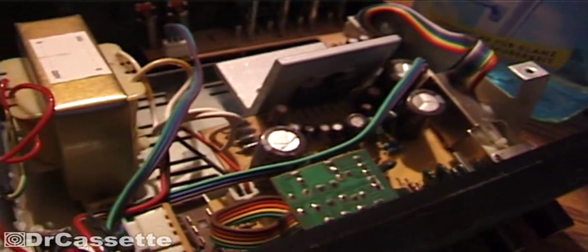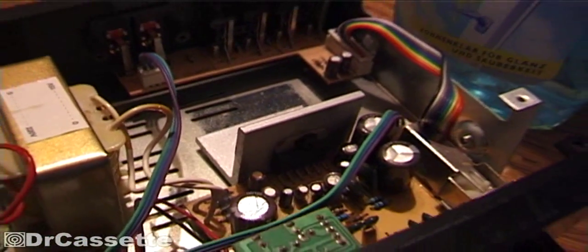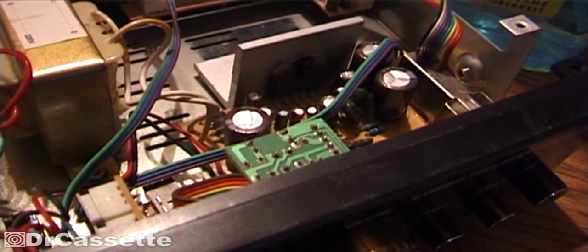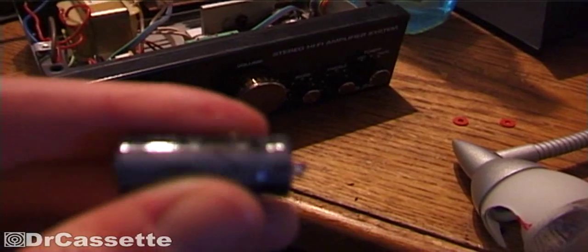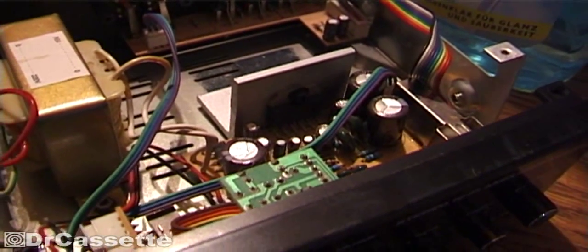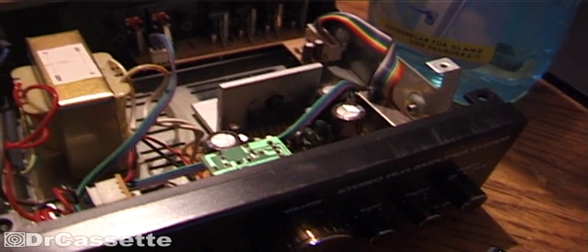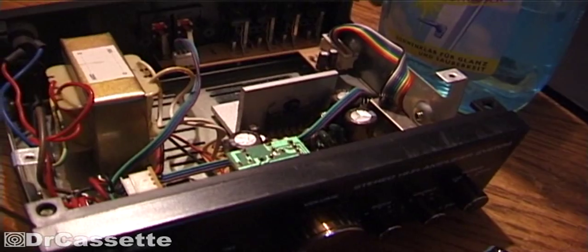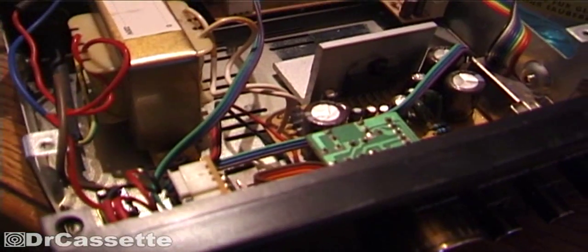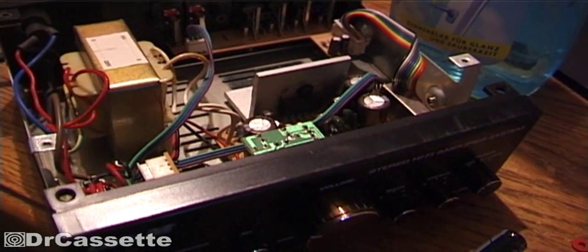There is that ridiculous little heatsink — of course it uses the bottom part of the housing as an extension. What I want to do, just because I happened to come across one, is replace the mains filter capacitor. The one currently in there is a 2,200 microfarad, 25-volt capacitor. I found a 3,300 microfarad capacitor running at 25 volts, so I want to see if I can put that in. Once again, another proof that these chips are almost impossible to destroy — the datasheet says the maximum voltage for this chip is 18 volts, absolute maximum. I measured the voltage across the filter cap and it turns out to be a little over 19 volts.